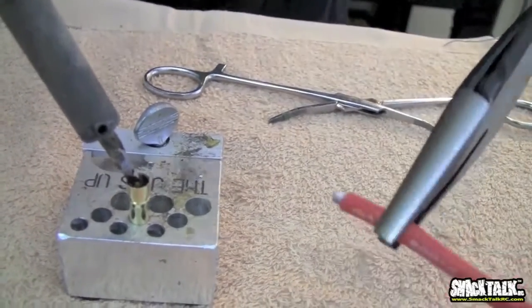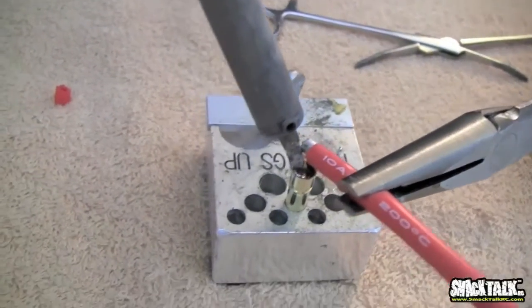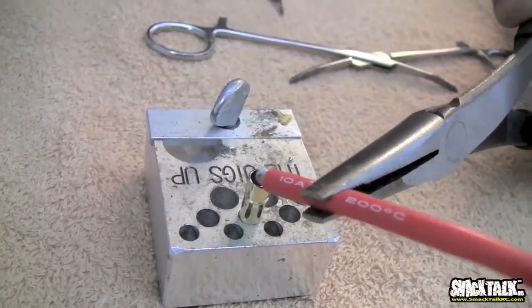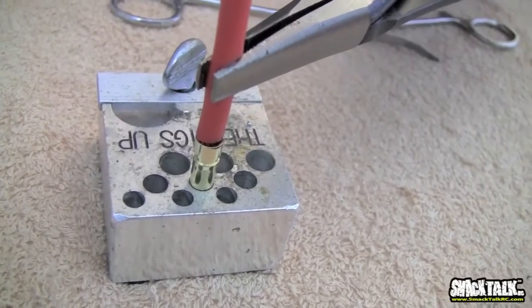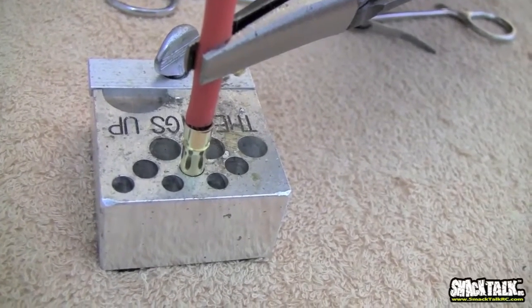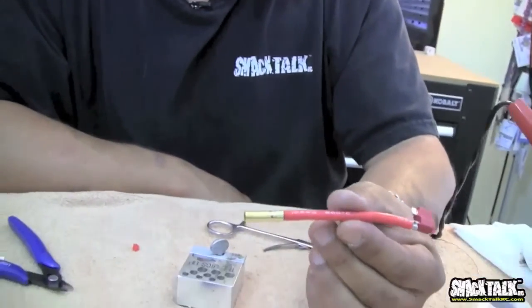Then you go back to your original wire. You hold the wire right next to the top of the tip. I know that's not ideal, but you want to get that wire hot again, to the point where it's getting hot. And once you start seeing that wire getting hot, then you very quickly go like this, and you stick the wire in, and you hold it, hold it, hold it, and you just make sure you wait enough, because that thing was so hot that it's going to take a few seconds to cool off and create a good solder joint. And that's about it.